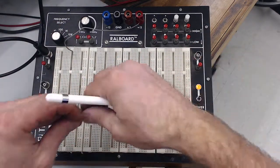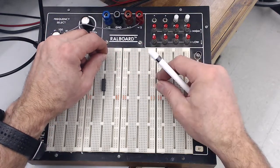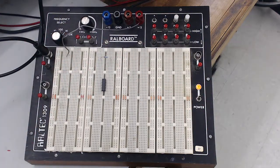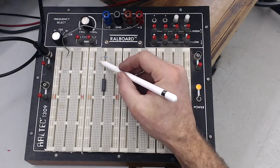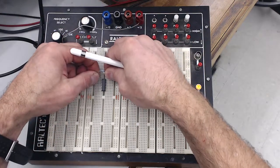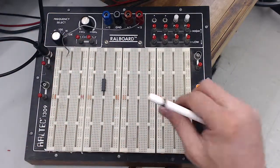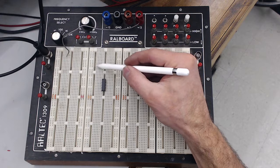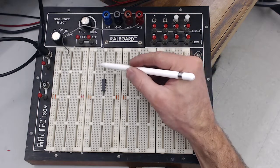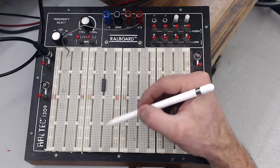You can do this with integrated circuits, but also with resistors and other components. You can set up a resistor and wire things in and out of it, or put it between two pins of an IC. Each set of five holes in a row is connected together, but none of the sets of five are connected to each other — that gives you flexibility.